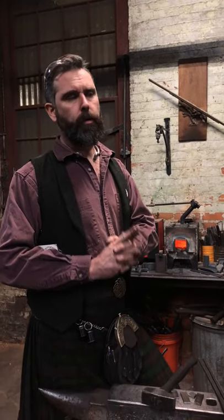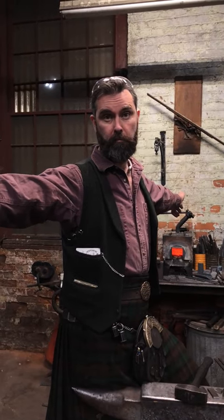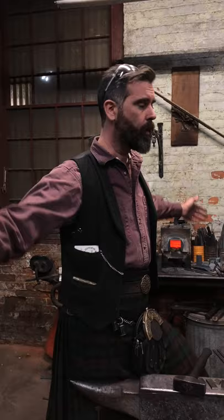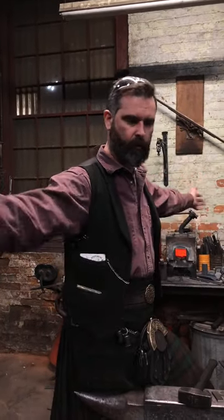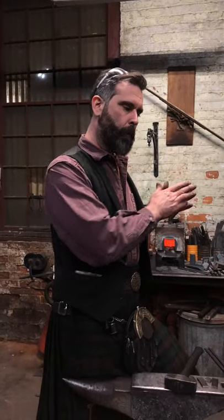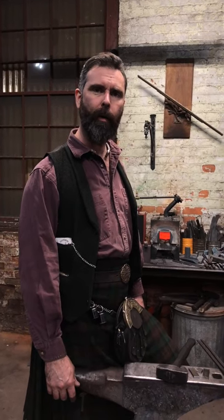If you are using mystery meat and junkyard steel, you don't necessarily know what you have. You have a good guesstimation. You know that I have yay much of leaf spring, and it should be 5160. It might not be 5160, but it's plausible it was, because it came from a 1975 Chevy K10, right? So you know more or less it should be this thing. As you work down the blade, or down the spring, you get consistent results until one day one of them just breaks slap in the middle. You're like, why the heck did that one break?